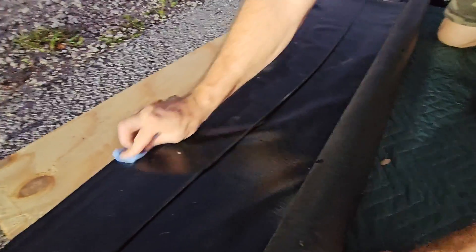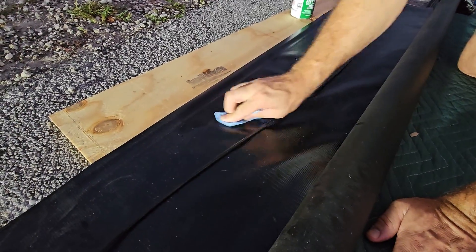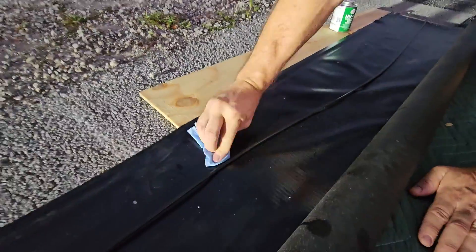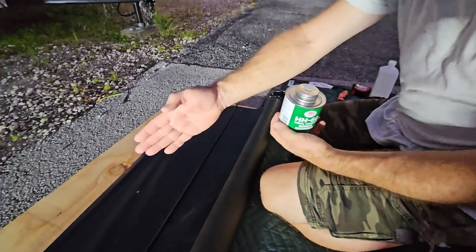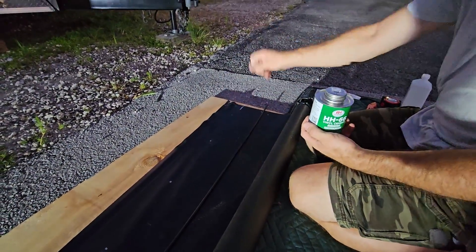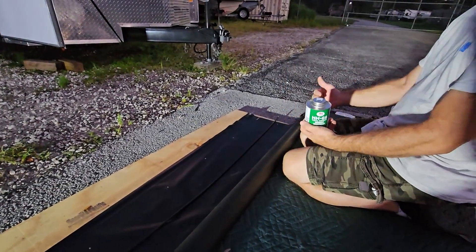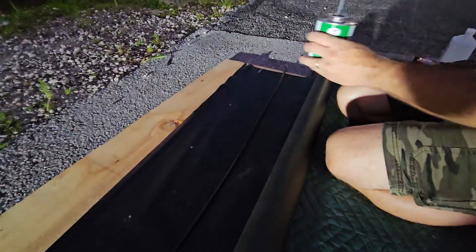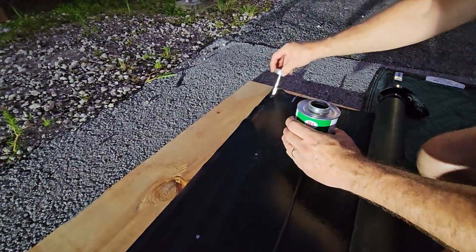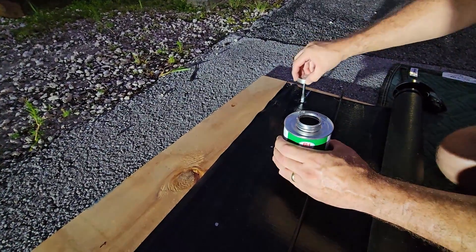Go around the marker marks so most of the surface is wiped - you do not want to take those off because that's your whole reference to line you up. We're running out of light here, we've got the headlight from the golf cart on it. We'll wipe this all off along the whole rest of the way, then spread our glue out. We got it all wiped with alcohol - now we're going to put the HH-66 along the whole thing, from our line up to the edge, and let that sit three to five minutes before making contact.